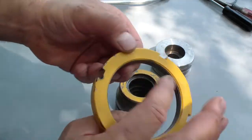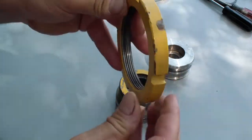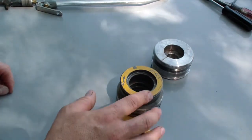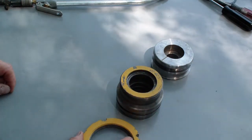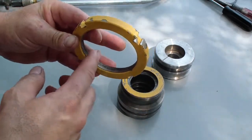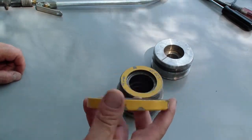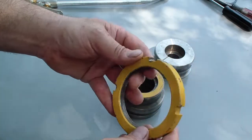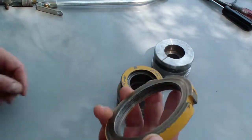The hammer drill is the way to go. This is the only damage done to this nut. When I rebuilt the bulldozer, I tried to use a pipe wrench. I tried to use a wrench designed for the pistons or cylinders. Nothing worked. I heated them and when they came out, it did mess up the thread. So I had to replace the two front cylinders. I was able to open the other three. However, the hammer drill is the way to go. It generates enough vibration and puts enough load that it will break this loose. This never been opened before, by the way.